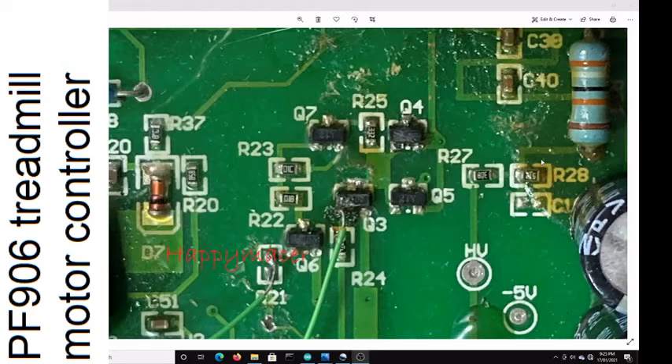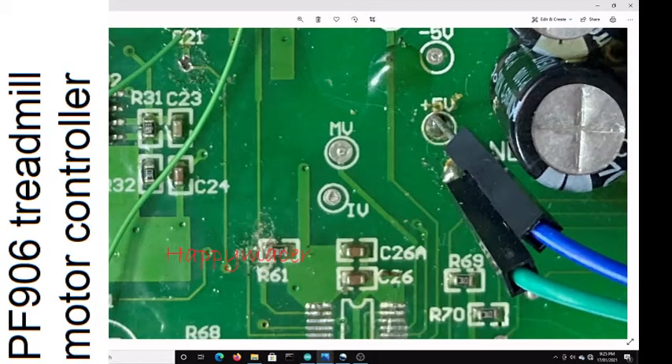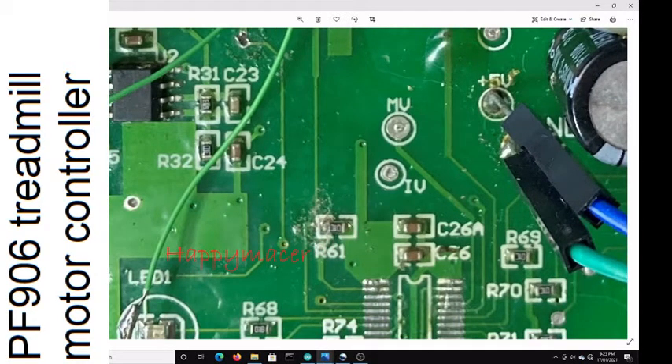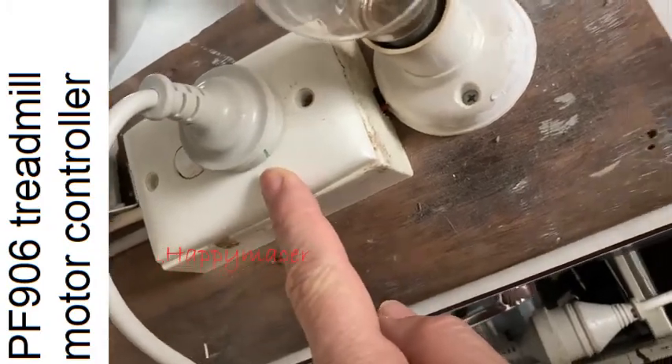There's a conformal coating or glue-like substance all over the circuit board that melts under higher temperatures like a soldering iron — it's all over the place and a bit messy, but it may provide a seal for the components. Here is the HV connection point, the minus five volt pad, the plus five volt pad where I connected the Arduino positive supply and ground supply. This is the motor voltage terminal — IV is the current motor terminal. R61, which I've now taken off the board, is a 10K resistor that was pulling the signal high from the plus five volt pad.